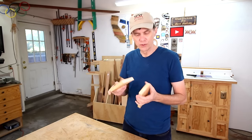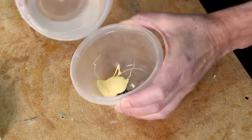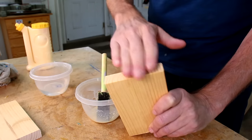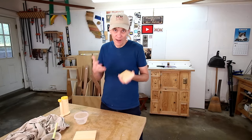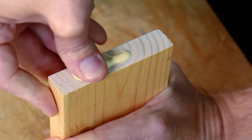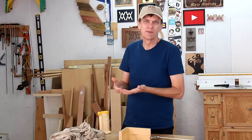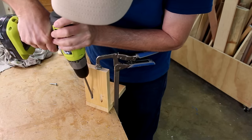There are a couple of techniques you can use to improve the strength of end grain glue-ups. The first is to make a sizing for the end grain — a sort of preconditioner. Make a mixture of half glue and half water and brush it on. The thin glue fills in those pores easily. Let it dry for a while, then glue together your pieces like normal with full-strength glue. Another method I usually use is to force full-strength glue into the pores of the end grain — just smoosh it in. You'll see and feel it being absorbed. Then let it dry a few minutes and glue it up as normal. If this is going to be for a chair or table subjected to force, I would reinforce the joint with a mechanical fastener like pocket screws.